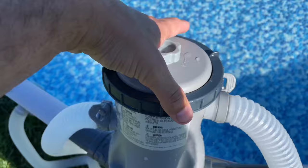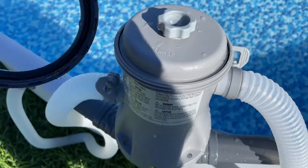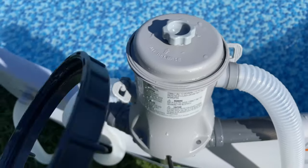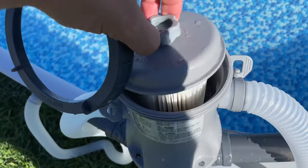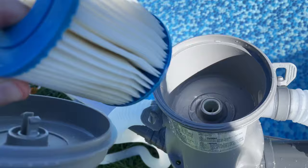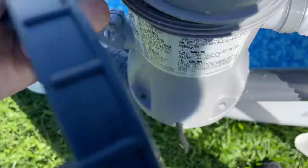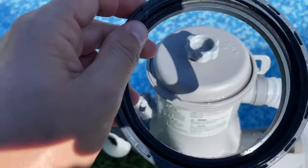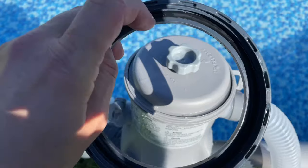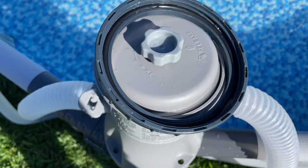First thing you want to do is lift it up and turn your power off — I've already turned the power off. If you want to stop the water from flowing, you can just lift it up and the water's not going to flow through anymore. So let's look at this. We have our filter — I just changed it, it's pretty clean, the new filter just sits in the middle. The next step: this black o-ring, the rubber ring, is on the inside of the cap. That is not correct, that is not where it's supposed to be, and that is why this filter is actually leaking water.